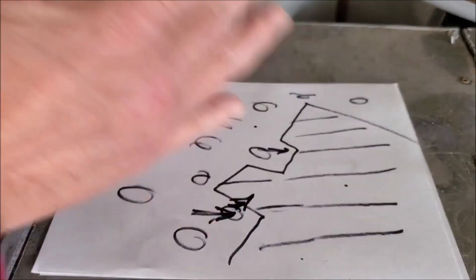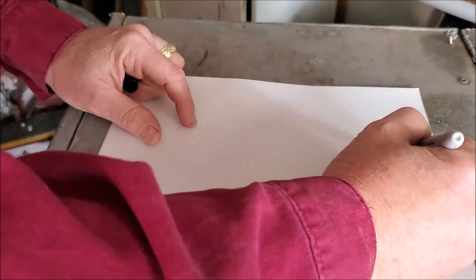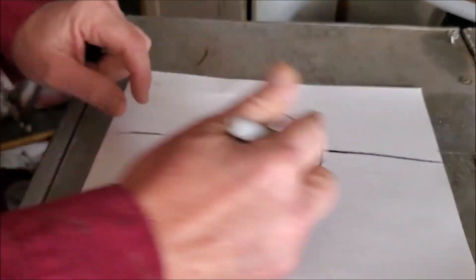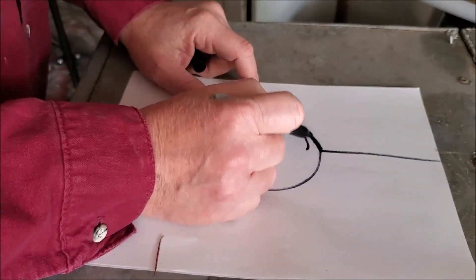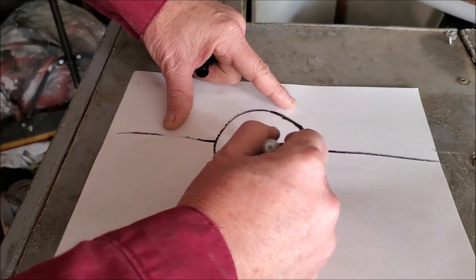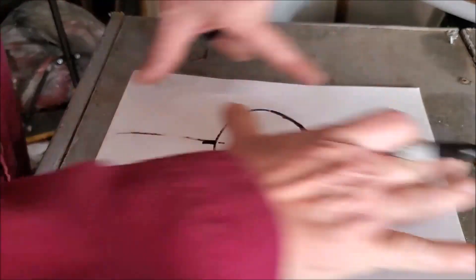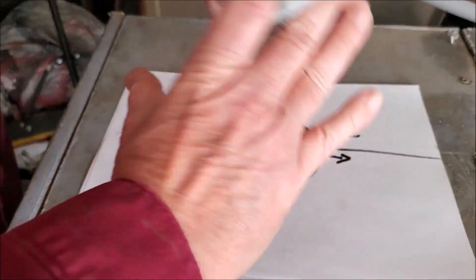One of the two — original or mold — has to be able to hold its shape under pressure. The second concept is the two-piece mold: you have your object in the middle, a cut line, and two halves — top and bottom — that come apart and go back together. What you want is the edge line to be perfectly aligned. If the sides are offset, you won't get your perfect shape — it'll be misaligned, or you can twist and torque it.